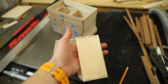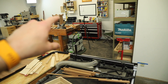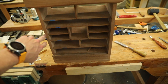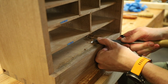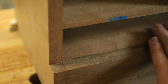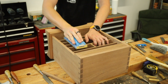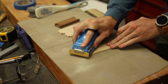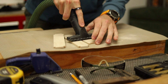The bulk of the work is now done on all of these drawers — got them all dovetailed. Now before I put the bottoms in these drawers, I first need to clean up the box itself because there's glue squeeze out on the corners, and I can't put the boxes in all the way until I do that. I'm going to scrape off the glue, fit the drawers in, and then glue the boxes up with the bottoms in them.